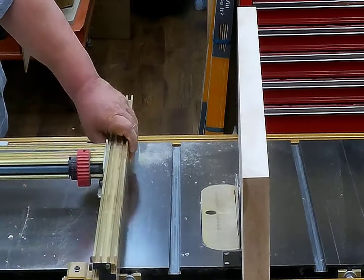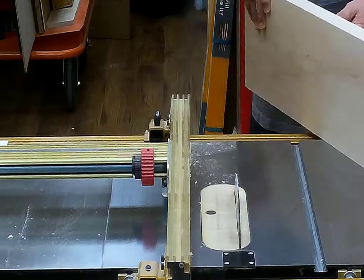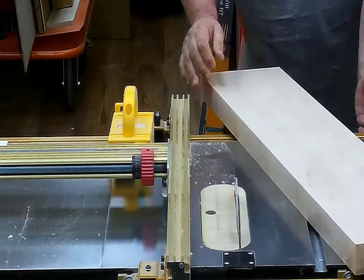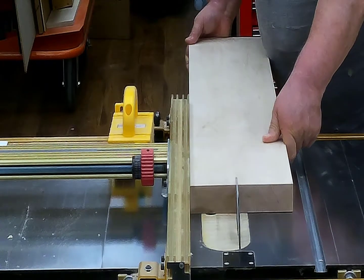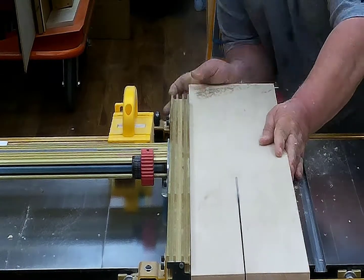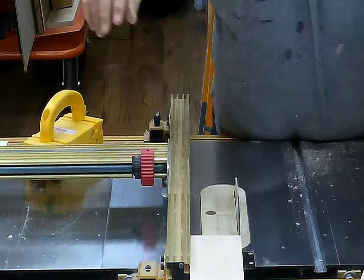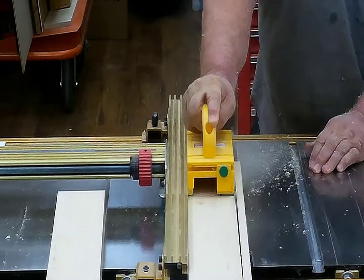First up, we need to adjust the saw so that I'm cutting just a little bit better than 3.5 inches. I'll come back later and trim the pieces back to 3.5. That way I'm taking just a little off each side so I end up with clean lumber and no burns. As we all know, maple burns really bad. I will use this cutoff for making the pads for the clamps.